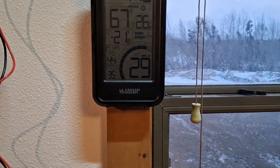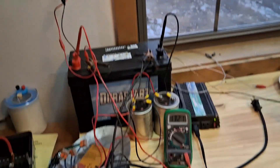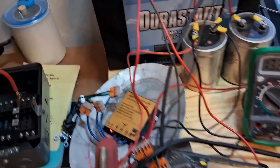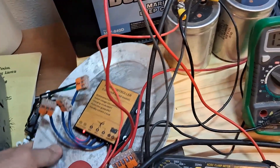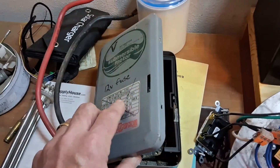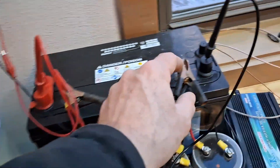It just updated — was up to 29 miles per hour. I think that gives you a good indication of what you can expect from this wind turbine under real-life conditions. The wiring setup is how I would have it — I just need to mount everything for permanent connections. I pulled this 12-volt fuse box out from another system I had. Right now it's not fused, so I don't recommend that. The inverter has its own fuse so that's safe, but the other lights are just clamped on — probably fine for temporary use.